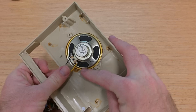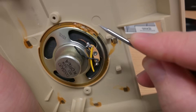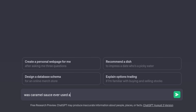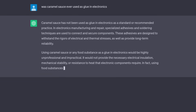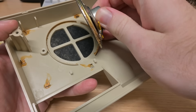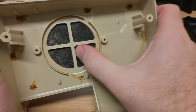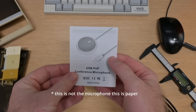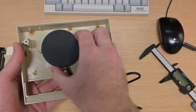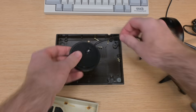The first hurdle is that we have to figure out how to get out the old speaker. It is glued in with what looks like caramel sauce. I was able to scrape away enough of the caramel sauce to get the microphone pried up a bit. And then behind it is just these little pockets that let the audio go through to outside the shell. I bought this little microphone — it's like a conference room microphone, so hopefully we'll be able to talk to it from a few feet away. We can just take that, and luckily it lines up with these holes pretty well. To do a test, I just put everything kind of back loosely together and tried to see what it would sound like.